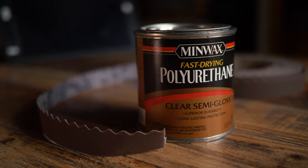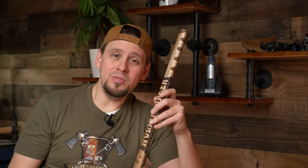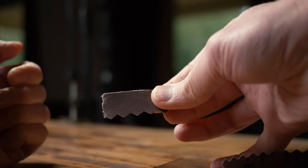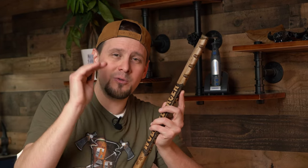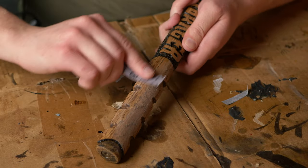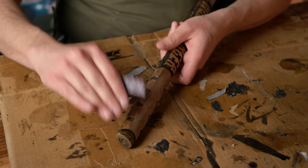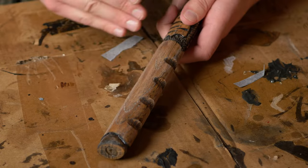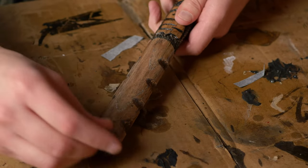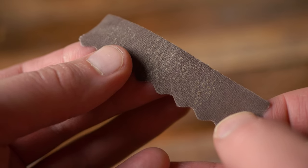You would have needed to coat it one time with urethane or some type of poly. This is where the sandpaper comes in — I'm going to tear a small piece off here. Since I've already coated this one time, I am going to take this piece of sandpaper and lightly start sanding the whole thing very lightly. The object of this is to sand down the first layer of urethane and then reapply it. You can already see the haze building up. I don't want to do this too hard, so I'm just lightly going over it. This lightly sands the first coat of poly down, and when we put the second coat on, it's going to go on smoother and knock off any dust.